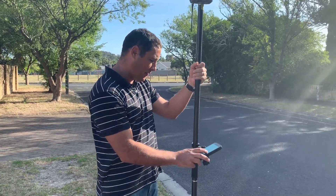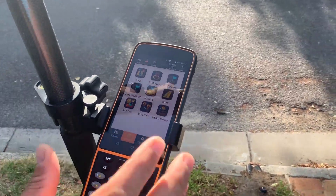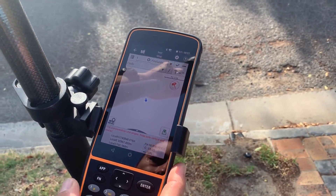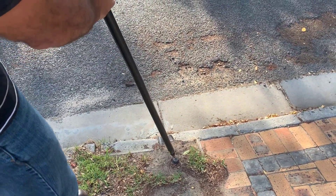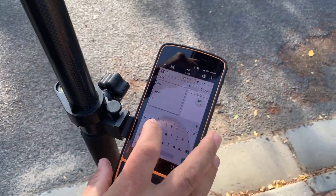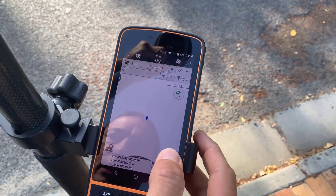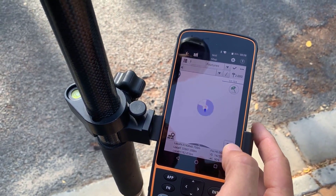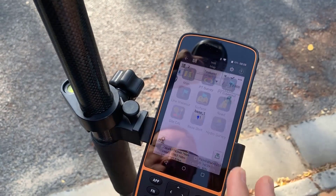To start, I'm going to immediately go in and survey a point manually. I want to show you the actual process as I measure a point. First of all, I'm just going to locate a point on the ground, which I'll quickly measure with the bubble intact. Let's give it a code and measure that. I'm using the plumb bubble and the bubble is fairly plumb at the moment.